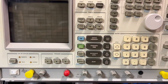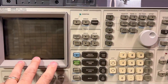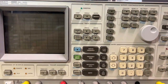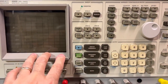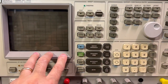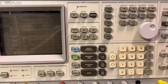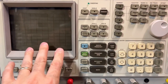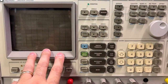I've been through display issues with this before, so I knew where to start. I opened the instrument cover and checked all the voltages — all the voltage rails were good, all the green LEDs on the regular cards were lit, and none of the yellow LEDs were lit. So I knew all the rails were good and none were overloaded. Then I happened to notice there was a fuse on the XYZ analog board down at the bottom, and it was blown.